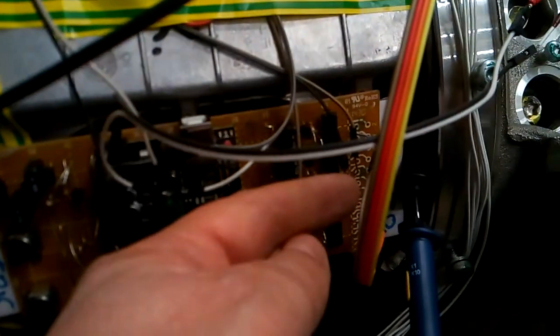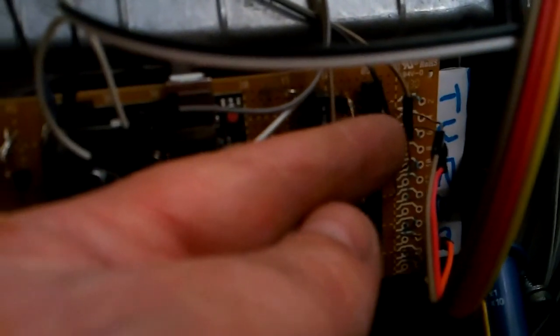These circuits here turn a single-ended output into two outputs, high and low. So drive high, it turns on the high side. Drive low, it turns on the low side and the high side off. Because I'm using bipolar transistors in here, I can set a bit of hysteresis, if you like, because I'm using the logic chip's output to boost the output so as to turn it into logic.